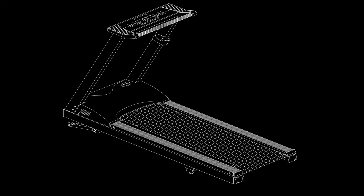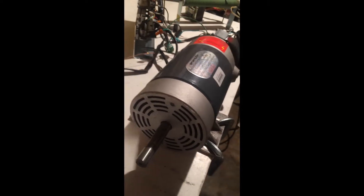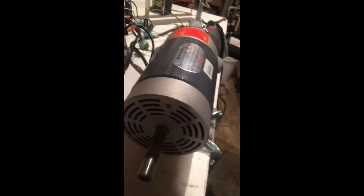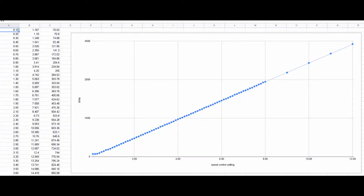I started by salvaging an old treadmill that I got for $50 on Craigslist, a SportsArt 6100E. Out of that very large industrial and heavy treadmill, I got a 3 horsepower continuously variable speed motor — a really burly motor that's really overpowered for this job. I measured the RPM, and it varies from about 70 at the low side to about 3,000 RPM at the high end, so it's going to be able to cover whatever I need it to do.